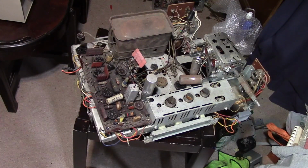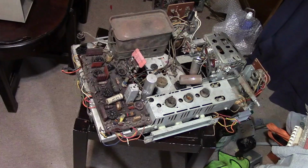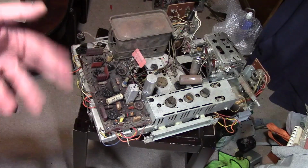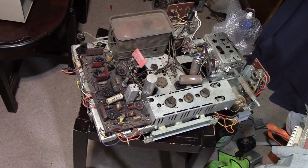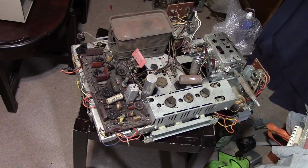And as far as the power consumption on a vintage TV, 95+% of it, 99% of it is going to be heat. A minuscule amount of the power consumed ends up being visible light, a minuscule amount ends up being sound, and a minuscule amount is used in the pilot lights. The rest of it is just all waste heat, primarily the tube filaments. So 21-inch set, 0.6 amps through the tube filaments. With 117 volts, 0.6 amps, that's 65, 70 watts just to light up the tubes, nothing else. So does every other TV made back then. In fact, most of them had more tubes than this, so they'd generate even more waste heat.